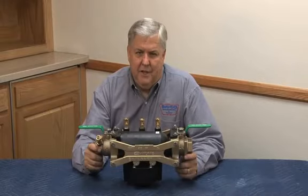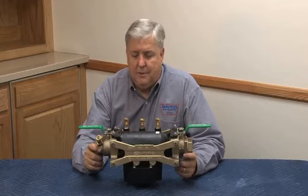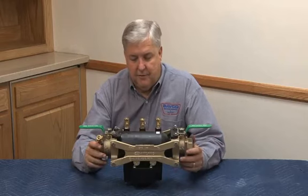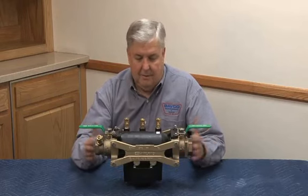We want to talk about the 1¼ through 2-inch in the 350 double check and 375 RPs, which are quite different than the smaller 3/4 and 1, which we've just done. Here's the RP version, the 375. The double check is similar, obviously, without the relief valve. But I want to talk about the valve itself.